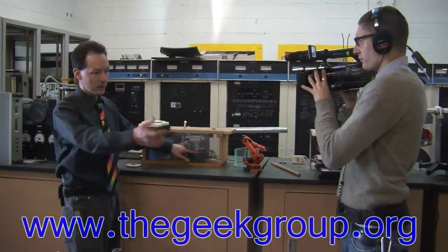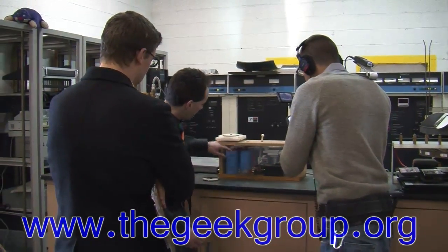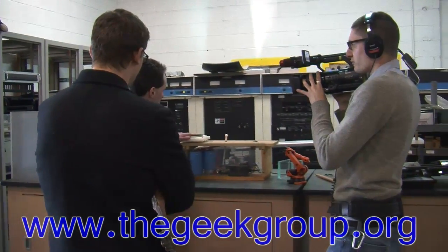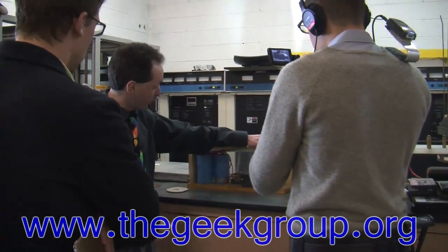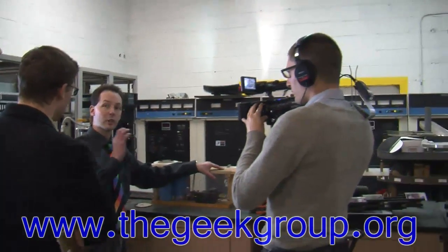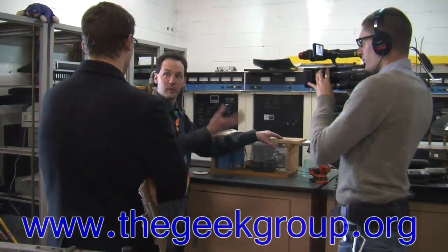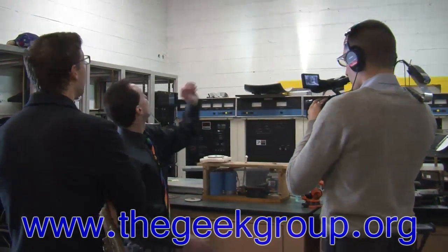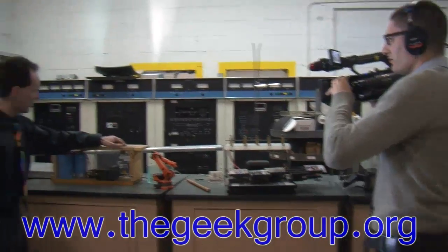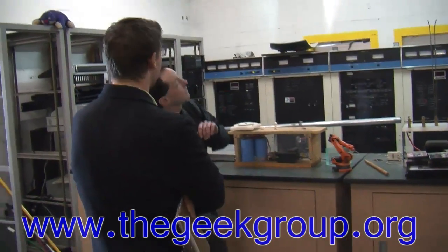What I have here is a little power supply, a switch, and some small capacitors. These capacitors dump all their energy through that little coil of wire. When they do that, they create a magnetic field. If I put that on there, the ring will be inside its magnetic field. I charge up those capacitors, and when I dump that charge, it creates a magnetic field. That magnetic field induces an electrical charge in the ring. That electrical charge creates a magnetic field with the same polarity — they want to be away from each other. So when I let go of the button, the ring flies. It works really, really well — simple science. If I put a whole stack of rings on there, I charge it and let go of the button, and the rings go up to the ceiling.